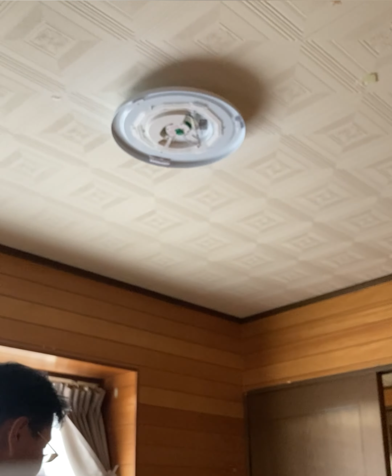First, make sure the power is actually working. If the light doesn't turn on, it could be due to reversed wiring or poor contact. Always test the light before installing the cover, otherwise, you'll have to remove everything again. Second, check that the fixture is firmly secured. If it's loose or tilted, it might not be safely attached. Confirm everything before closing it up.